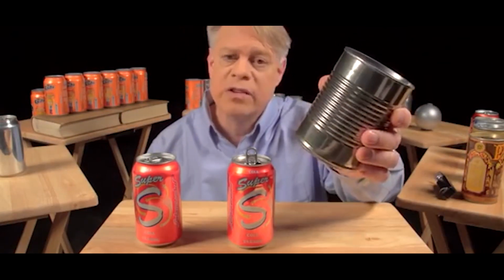It also adds enough strength so that the can doesn't need the corrugations like in this unpressurized steel food can. While initially pressurized to about 2 atmospheres, a can may experience up to 4 atmospheres of internal pressure in its lifetime due to elevated temperatures, and so the can is designed to withstand up to 6 atmospheres or 90 psi before the dome or the end will buckle.